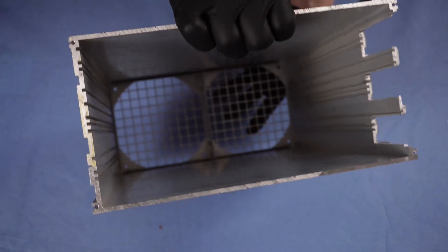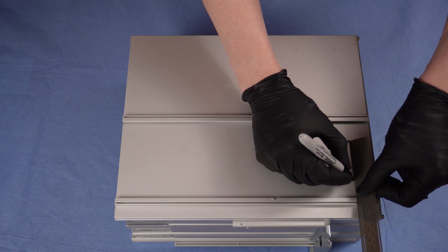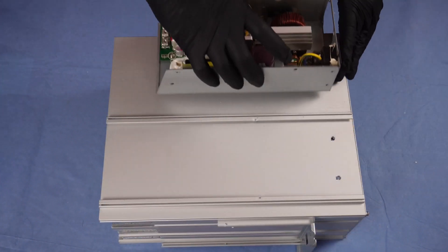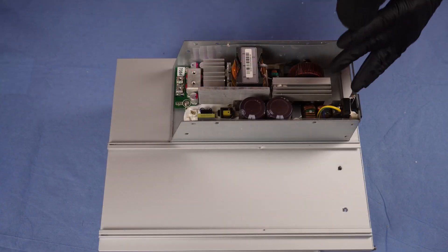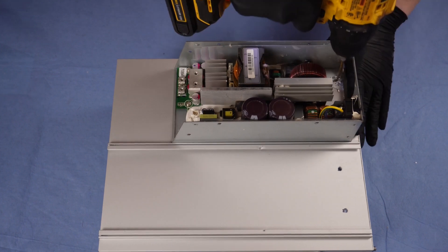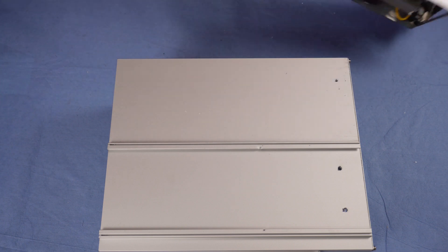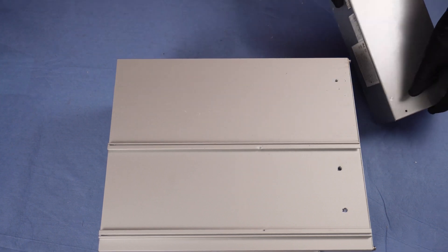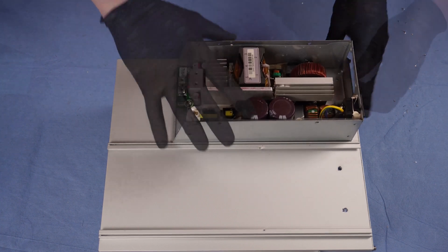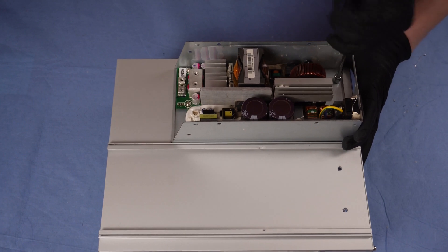I started with an empty S19 case, and my first step is to put two 3/16-inch holes into the side of the case. These will be used to secure zip ties which will hold my Wi-Fi repeater in place. When it came to attaching my APW3, I decided to take a simple approach and just bolt it in place using a self-tapping sheet metal screw. The miner will be sitting upright in my immersion tank, so the APW3 will just hang from this single point. I had to be careful not to allow any metal shavings to find their way into the power supply where they could cause a short.